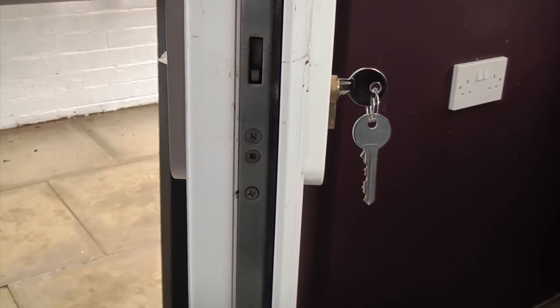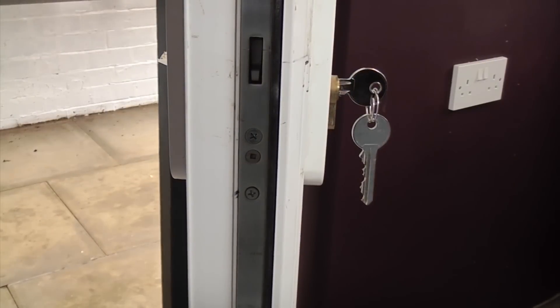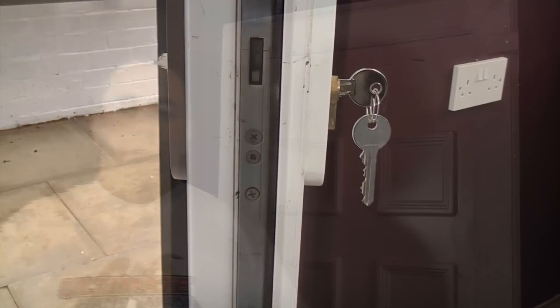So if we get a 40mm internal and a 50mm external lock, we should have the correct lock to be fitted. I've now been online to the abs-secure.co.uk website and purchased the correct lock. This type of cylinder cannot be bumped and it cannot be snapped, so this is a really good security upgrade. If you've got a normal Euro cylinder in your door it is a weak point — somebody could quite easily break in through there. You're much better off buying one of these. It's a British-made product, made to an extremely high standard, and it is very secure.